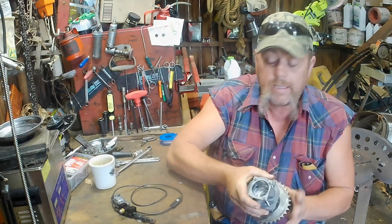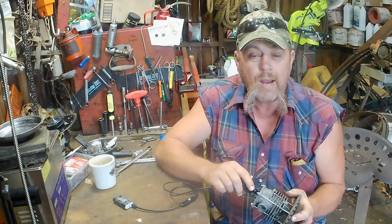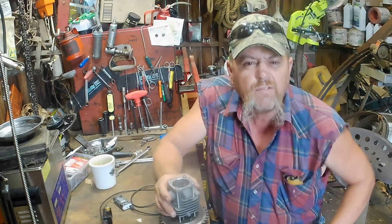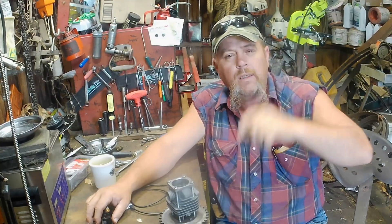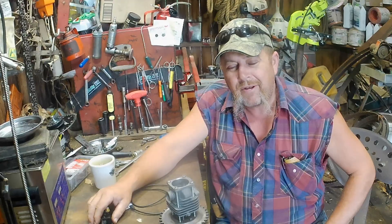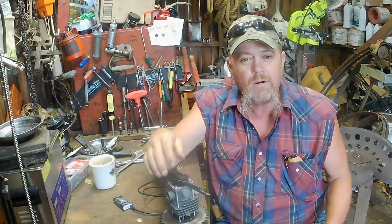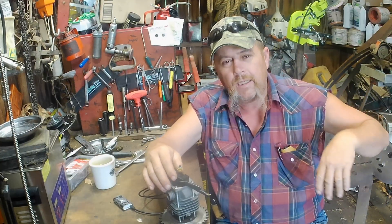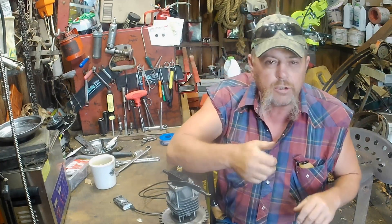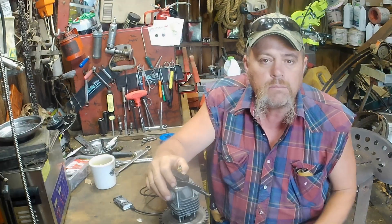It works. You guys remember way back when I scored that one cylinder - here's exactly how I did it. I went in with my boring bar and I thought I was zeroed out, but I'd touched off the wrong place. I was off, never even got to turn in the squish, and that cut a groove in that cylinder just a little bit from the top. I trashed it - that was my fault. To help combat that problem, since I don't have a DRO on this little stuff and it's hard to tell, there's actually not even measuring on the traverse side of the carriage. Any thousandth or two you want to do and be able to see, you've got to do a cross slide. There's a lot of problems with them, but you can make it work.